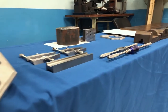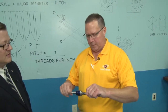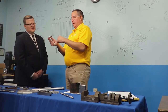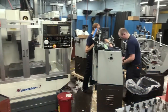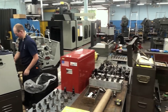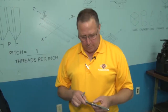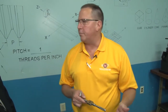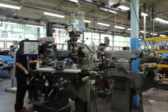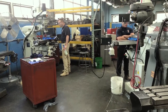This is kind of a transition of that finished piece. They're constantly machining the different components. The whole bar comes in this form here, and then using blueprints, they'll do all their turning on the lathe for what the requirement is on the blueprint. The students also learn some heat treating procedures, and they learn that we have air hardening material and we have oil hardening material, so they get a pretty good understanding of heat treatment.